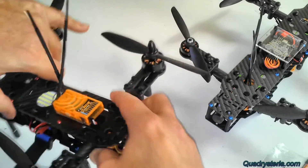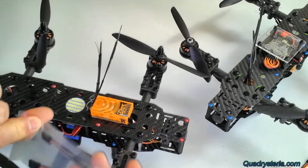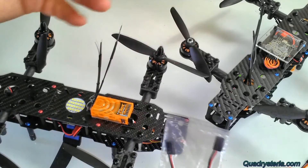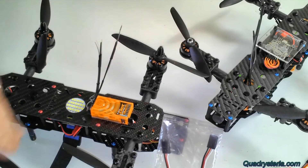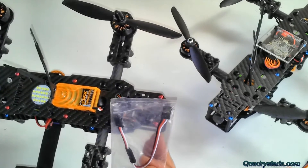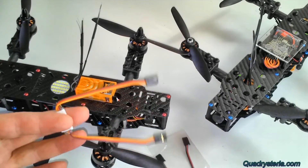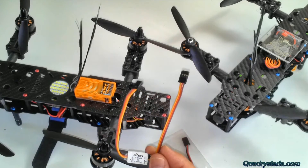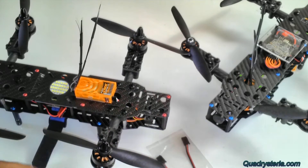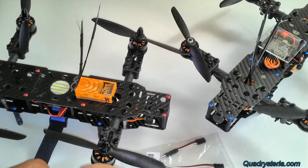The only thing you need for SBUS to go into the Naze is a signal inverter. For about five bucks, these little cables have a signal inverter. All it does is reverse the signal — instead of high being high and low being low, it's flipped. That's what the Naze needs to handle SBUS. Alternatively, you can get from FrSky an SBUS to CPPM converter, but it's more expensive and bulkier. You can hook that into SBUS and go straight into signal pin 1 on the Naze, but the SBUS signal inverter is the same thing — cheaper and smaller.